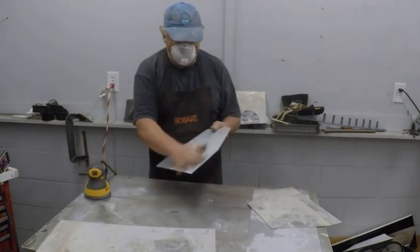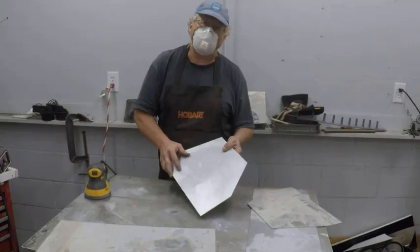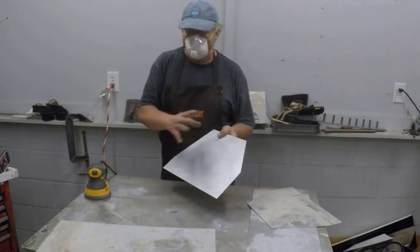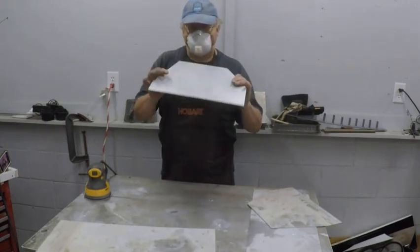Talk about right here. Get it down to that bare, bright aluminum. I'm gonna go ahead and clean this one more time. I'm just getting the rough part off right now, but I'm gonna probably go over this one more time with a little bit of finer sandpaper. Like I say, the effort I put into it right now, the 30 minutes it's gonna take me to prep this, is gonna save me a whole lot of aggravation when I go to start welding it up. Just a FYI.